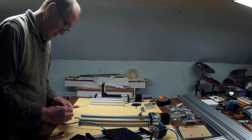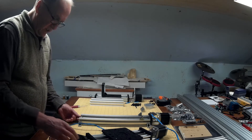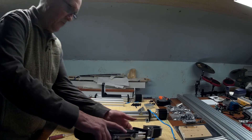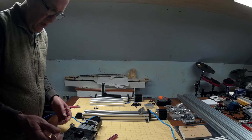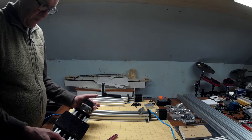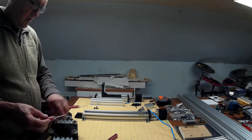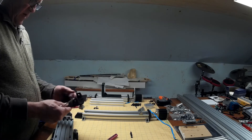I'll keep this stuff in place and put it back on there for a minute to keep it together. To remove this Y-gantry, there are four screws here into T-nuts — we have to take those off. And then we have to remove the corner brackets. That should free up that gantry plate.